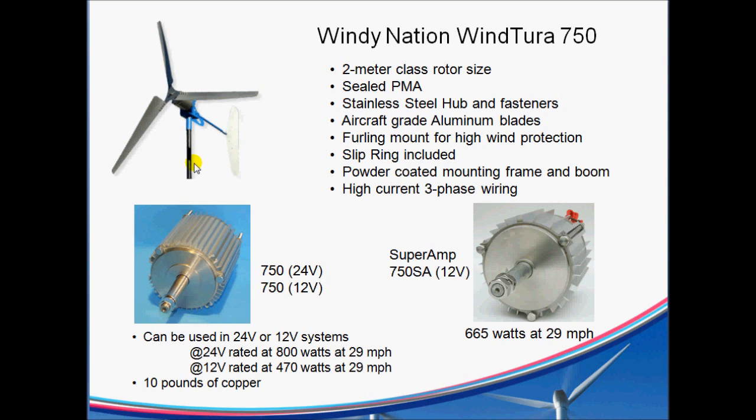If you have a wind turbine and you don't have any kind of furling, basically high-speed blades in high winds are going to create a lot of force on the pole, and if you're using like a one-and-a-half-inch pipe to hold up your turbine, there's a good chance that in high winds it's actually going to blow over. Having a furling system allows the blades to kind of furl out of the way, keeping less pressure on the mounting pipe, and it should survive the storm.